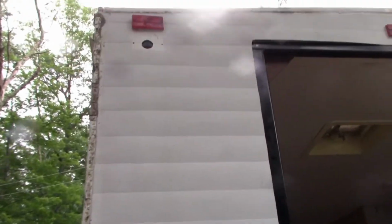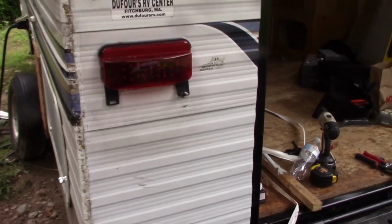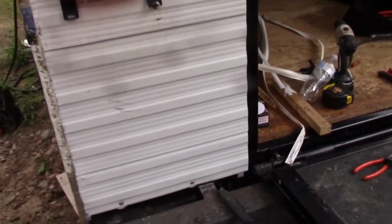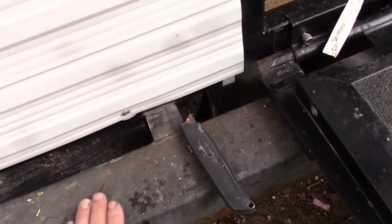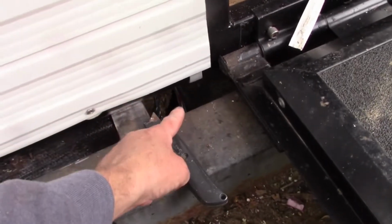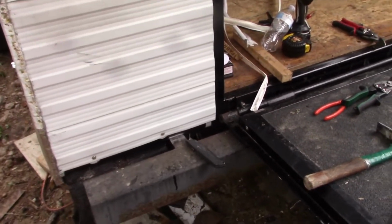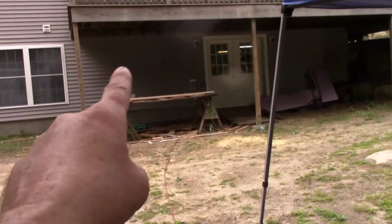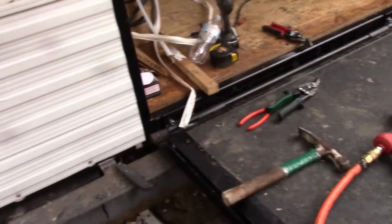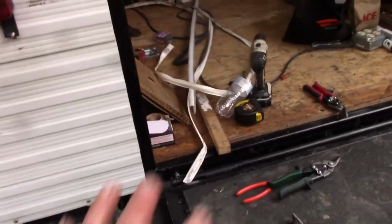So that's a good thing. So that's why I was able to pull a tarp off and finish up the outside. I gotta weld the new cross member to the old one before I cut the bumper off. And I'm gonna put some diagonal bracing and gusseting in there to prevent that frame rail from wanting to twist. What else? So anyway, I'm gonna bring my welder down from the shop, and my cousin made an extension cord to go from my generator outlet over there so my welder can park here and have enough leads to do what I need to do. So we're getting close, and then I can focus on the interior after that.